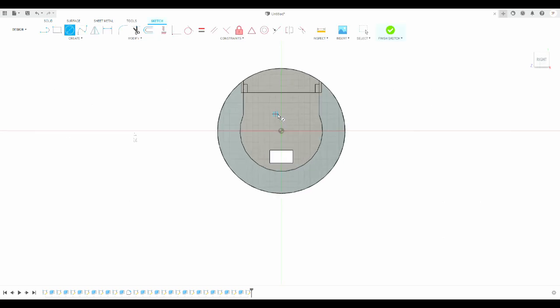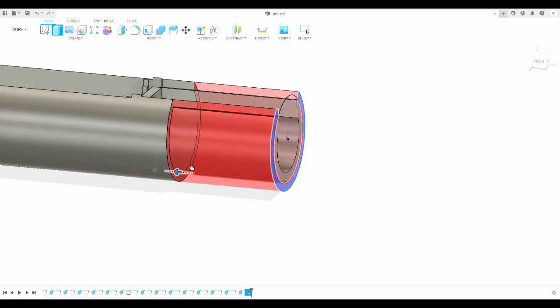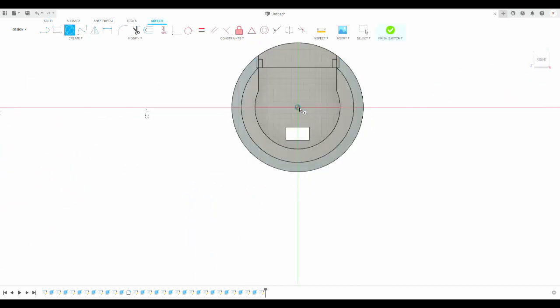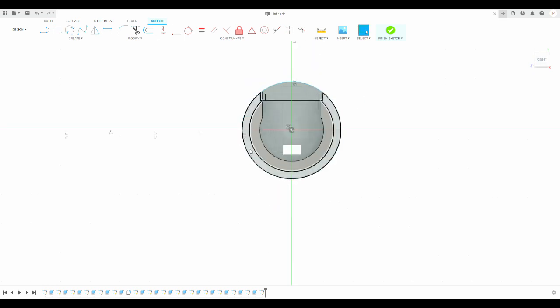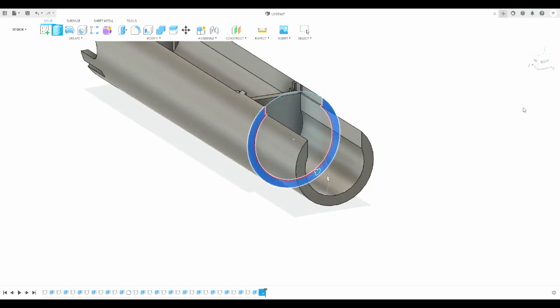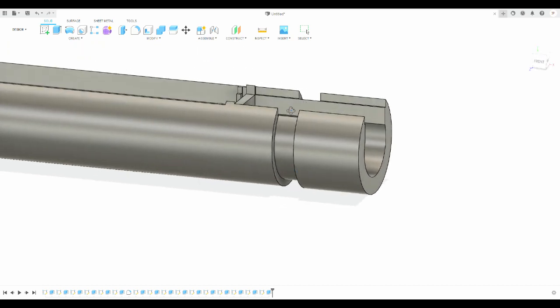I like to make my boards a snap fit, but in case they're not I'll draw this anyway. I drew the circle, I'll bring this to about right here — this is going to be for a piece of art tape. We're going to draw a circle on this again for the full diameter of the chassis. I can grab this and extrude it. My art tape is a quarter inch thick, so I'll come over here to the start button and offset from my plane a quarter inch, because my tape is a quarter inch thick. Then I'll extrude to this object — just like that. Now I've got this little piece right in here for a piece of art tape to hold the board in if need be, and it's a quarter inch thick.